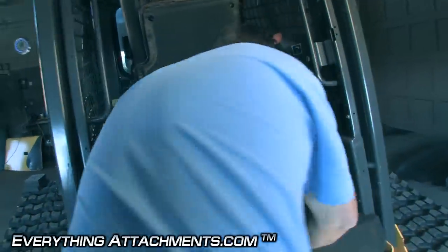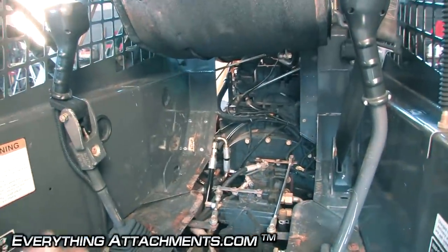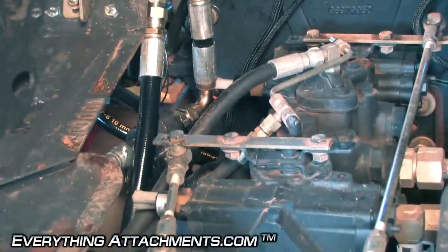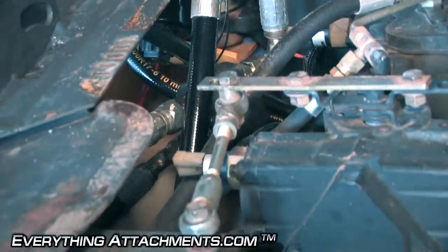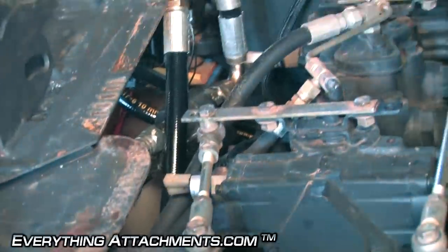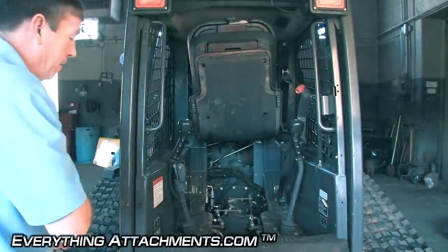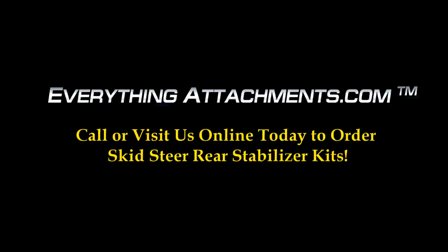So we have simply a pressure adjustable relief valve right here — it's a separate unit. We've gone directly through the pressure relief valve, and if you bottom out a cylinder, it has a line coming off the side which we've come back to the end pressure line on your control valve with a T. So one way or another the pressure can get around that valve to get to your main control valve. It's electric over hydraulic — none of the hydraulic components are inside the cab with you, so this makes a lot neater way of doing it. We can help you with your instructions on each different application as it goes. Thank you.